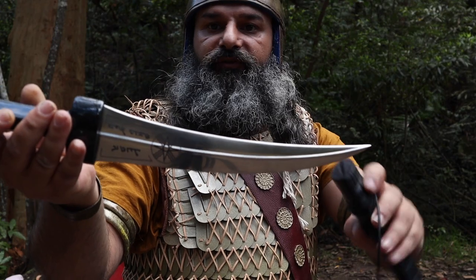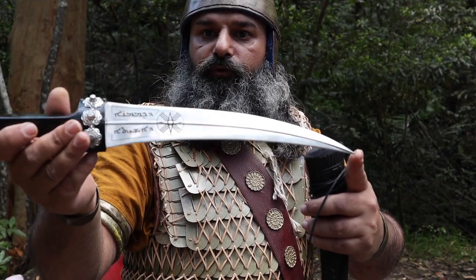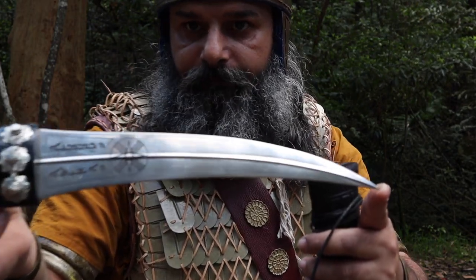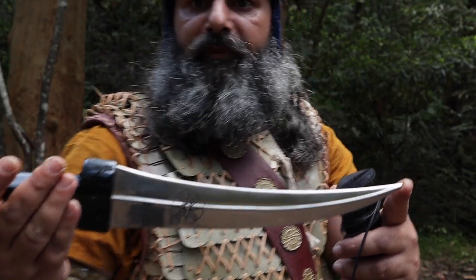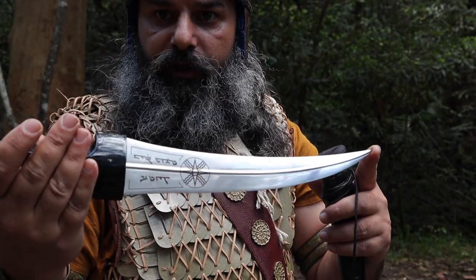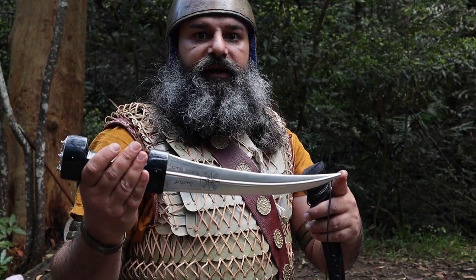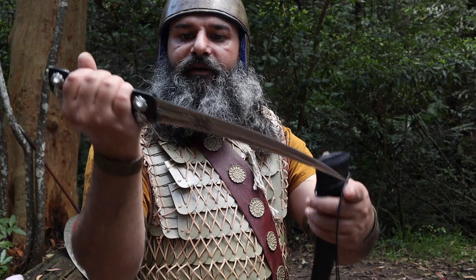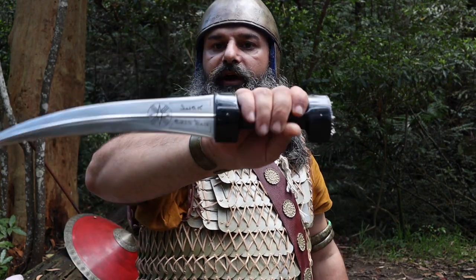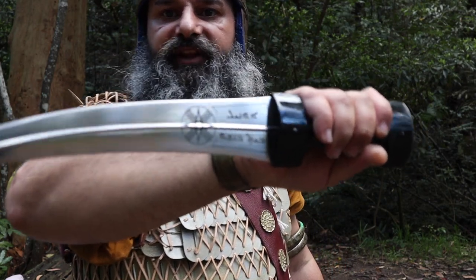The blade itself, from a flat bar of stainless steel, I was able to do raised ribs on both sides and polish it. I didn't want a mirror finish polish on the stainless steel, because I think that looks a little bit too much like cutlery. I like the little bit matte finish on the shine. I went up to about 800 grit on this particular dagger.